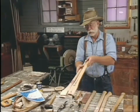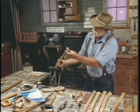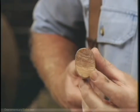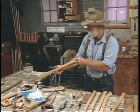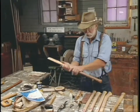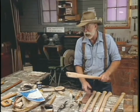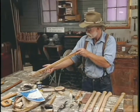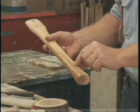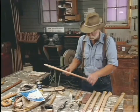This, on the other hand, is also a 28-inch double-bit handle. If you can see, the grain runs the wrong way on it. With percussion, the grain running that way is going to pop it loose under pressure. This doesn't have a good feel to it. It's also got a shellac on it instead of a wax like the Link handle. And it's got heartwood in it — good hickory handles should not have any heartwood. They should only have the sapwood. You can see the transition between the two here.